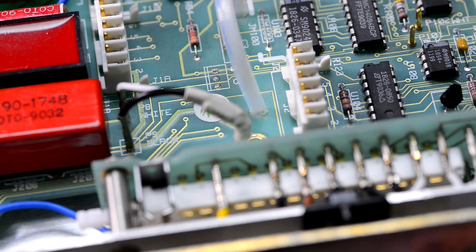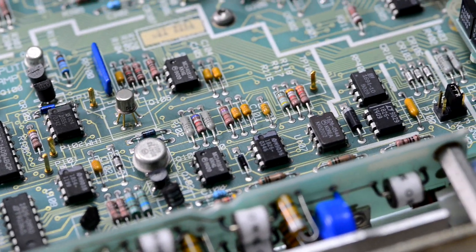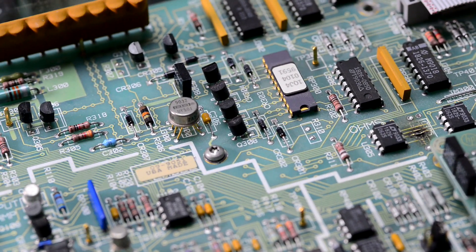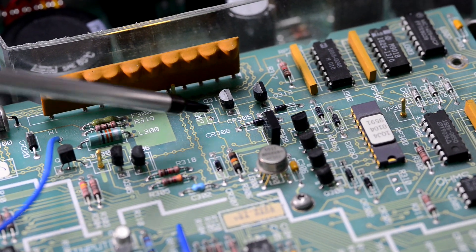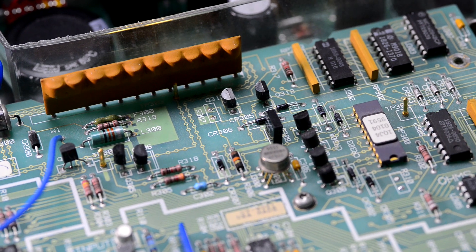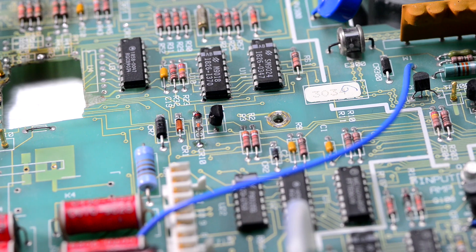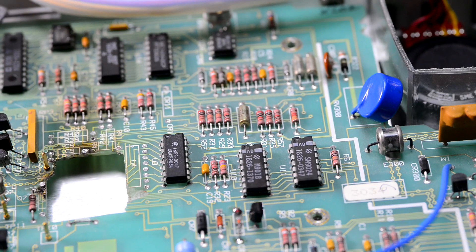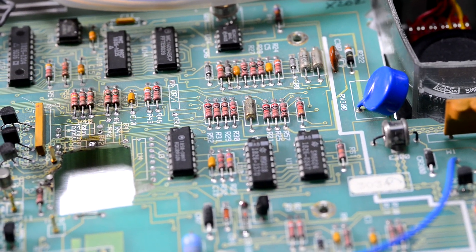So we have to put that back in. The A10 switchboard is there. We also don't have R310 and R307 film foil resistors for the current source for resistance measurements. And CR10 and CR11 are missing — we will have to figure out replacements for those current diodes.